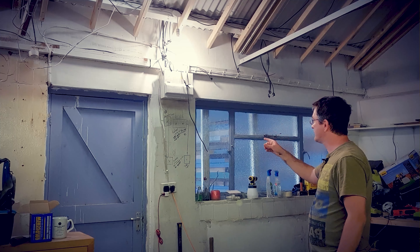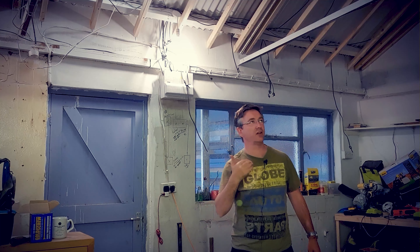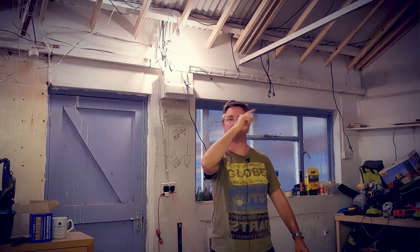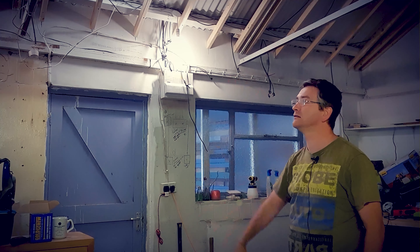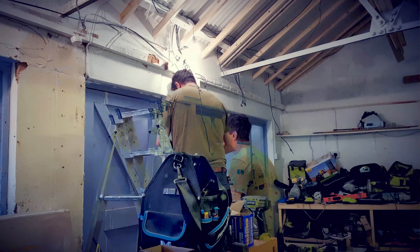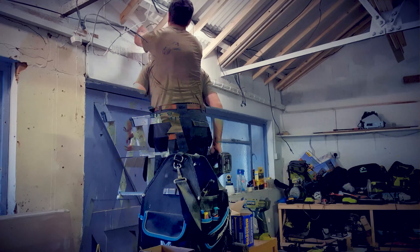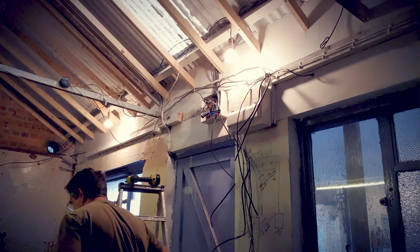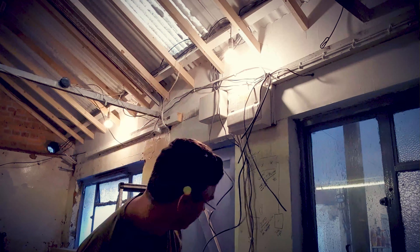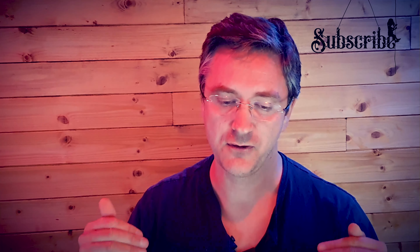All I need is one light switch. I'm joining all the wires up in a terminal box — it works like a large junction box. I've got a couple of terminals for live, a couple for neutral, and the earths connected up, all housed in the box near the consumer unit. There's a lead coming down for the switch and a lead going back up for power supply. It'll be switched on and left on, and then each individual wifi bulb can be turned off through my phone or Alexa.